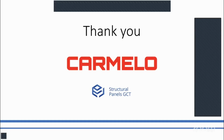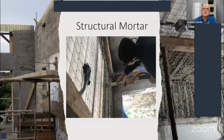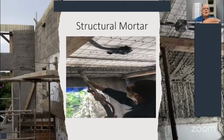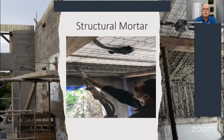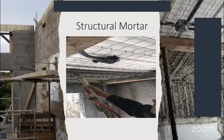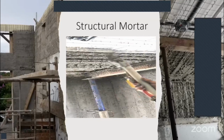But is that all at one go, or do you wait for the first part to solidify? You can apply it in three passes, three steps. Real thin, and then up to the mesh, and then put your pipes that have the 3/4 inch diameter, and that'll give you the 3/4 underneath the mesh. As a scratch coat for your finishing coat, it could be as little as 1/4 inch.